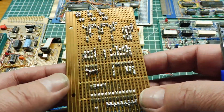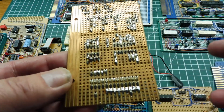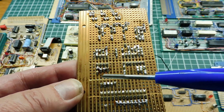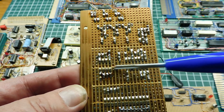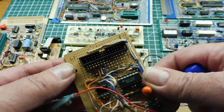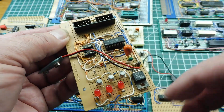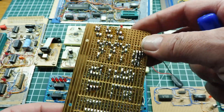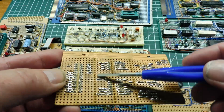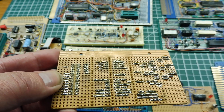Here's a project I built using that vector board. You can see where I've made my own isolation channels using a boring tool. There's one line there, one there, and one there — that isolates the board into three parts for my connector, my ICs, and my LEDs. This way you can actually make a very compact circuit, because you can customize where you put your isolation channels.